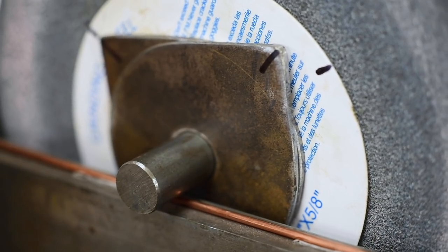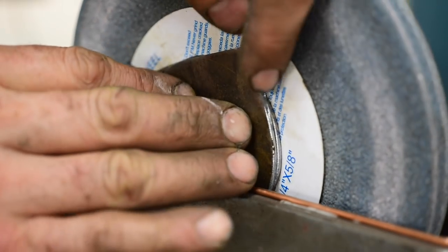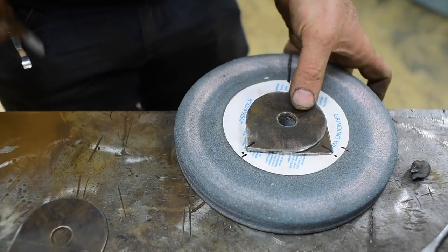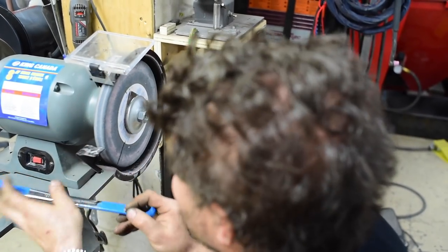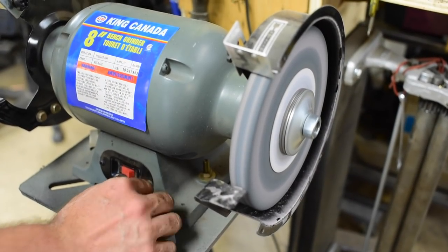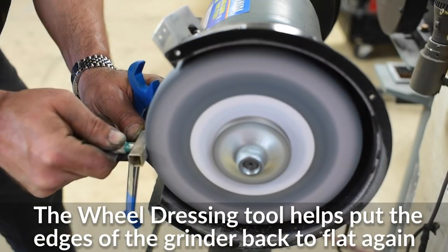What I like to do is try to keep the lobes sort of across from one another and see that my lowest point is always that black line that was marked before. As I slowly move and adjust each lobe up and up, at a certain point I'm going to get to where I've moved my center of balance of the wheel right on center of the arbor, and it's not going to have a single place that it wants to fall down.